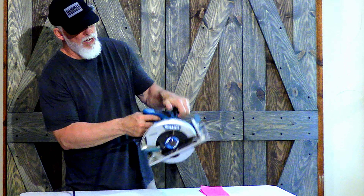I love the handle at the top where I can grab it and guide it. You can adjust the plate — anytime you're cutting sheet goods or any material, you want to set the depth of your blade. You don't want the blade too far down because it's going to chip your material, make the blade overheat and probably start warping, and it's a little bit of a safety hazard. To adjust, you use this handle in the back. All of the handles on this Makita are the same green color so they're easy to spot. You flip this handle and now the plate slides up and down. There's a gauge inside with a bar that goes from half an inch to two and a half inches, so I can set the depth of my blade anywhere in that range.